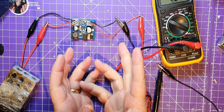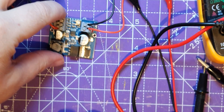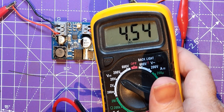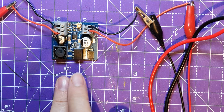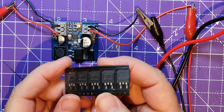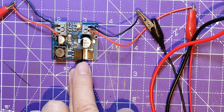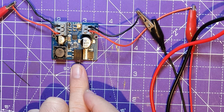The little metal earth around the potentiometer caused a big spark. I thought I got away with it, and if I look really close it does seem okay - nothing blackened - but then look at the power coming out: 4.5 volts. It should be 120, and it's pulling a load of current from my power supply. So I've got some more - they were about £2.95 for five - so I'm going to try and take this out and compare the voltages to see whether it's blown, or whether it's something deeper.